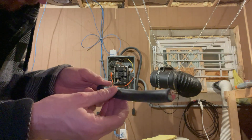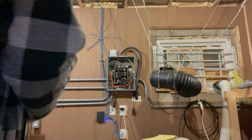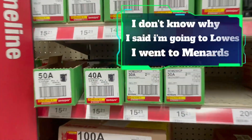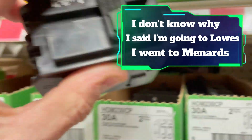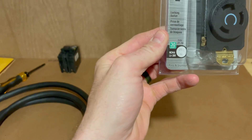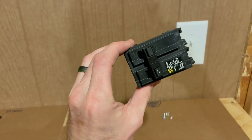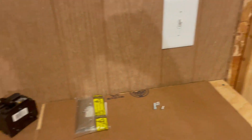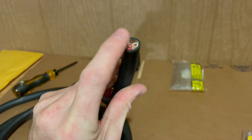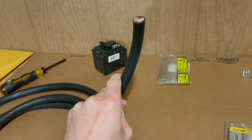I found a piece of the wire I used and confirmed it is 10 gauge. 10 gauge is what I recommend when running a 30 amp 240 volt circuit. I'm going to snap my fingers and then I'll be at Lowe's getting the wire I need. I've got my 30 amp L6-30 plug, my 240 volt 30 amp breaker, and my 10 gauge wire. I got 10/4 when I could have gotten 10/3 - one of those wires won't be used in this application.